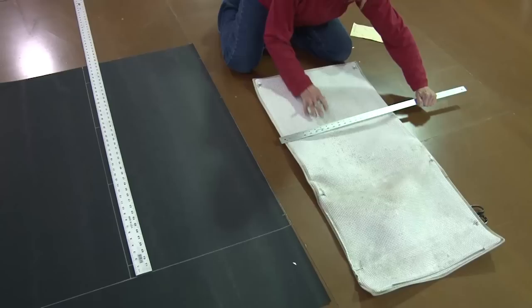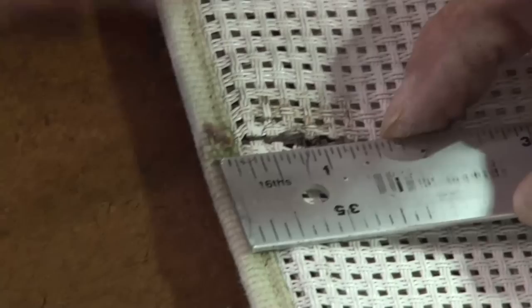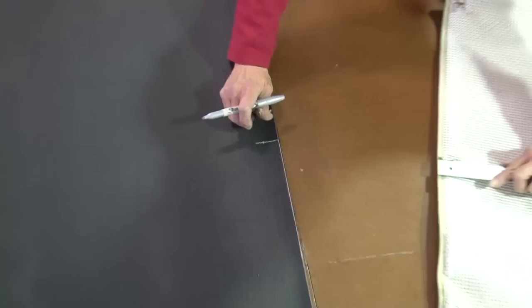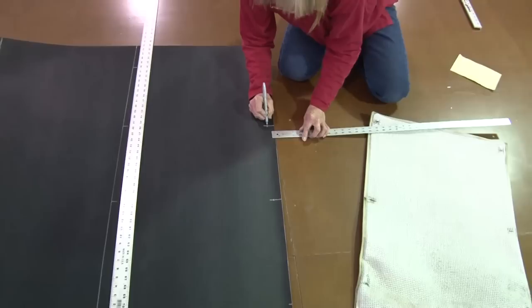Let's look at the old cover to examine the slits where the bolt protrudes — these are about an inch and a half, with the bolt coming out right at an inch. So we want to come in an inch and a half, make our line, and then one inch in from the edge — that's where the bolt came through. At each of these locations she's going to measure over an inch and a half and one inch where the bolt actually came through. The opening on your chair may be slightly different.